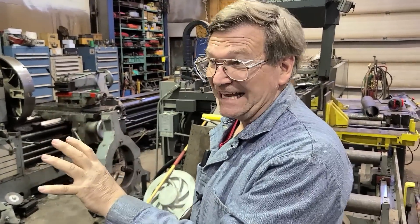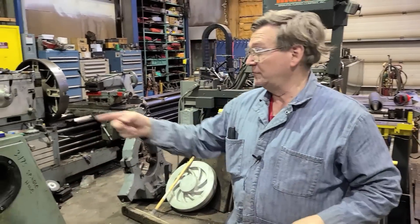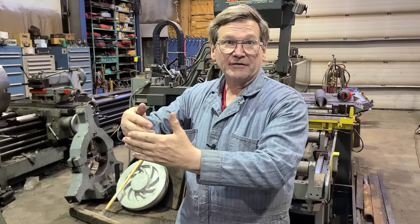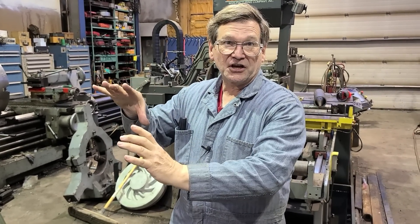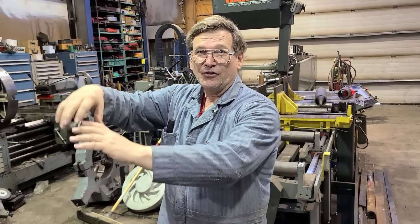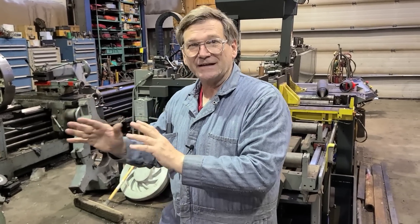Generally, if you're doing it by depth on a lathe, measure how far in you're going from once you get a full round cut. Pretty much all pipe has some extra material — sometimes extra material all the way around — that makes up for their out-of-round manufacturing. So they're pretty close to diameter once you get them round. That's not a guarantee, but you're usually there or maybe another 10 to 20 thousandths under on a pipe.